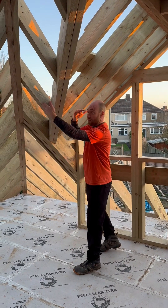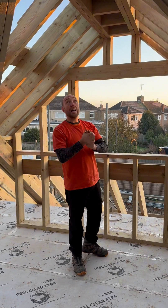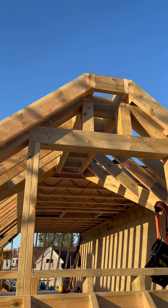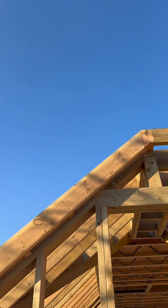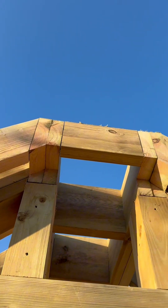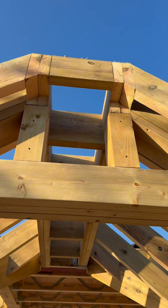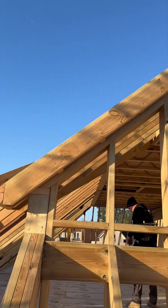The way these hips are, slightly bigger once it all gets insulated, I'll plasterboard it — trying to create nice sharp points. Got to think about all the cap bands. So that was it really — any questions, let me know; please subscribe to the channel as it really helps the algorithm, thanks a lot. Let's have a look at how we've done this at the front: the double's going through, we've done back to one at the same pitch as the roof so when the soffit comes up it goes straight up. We've done one square little noggin at the top and a barge board rafter — all worked out.